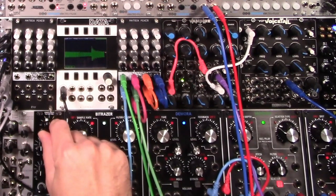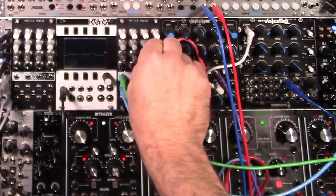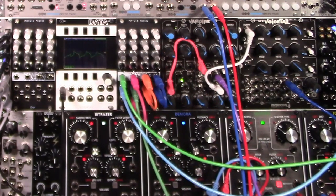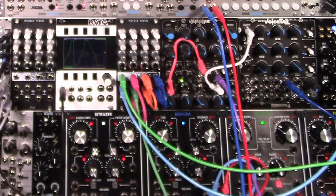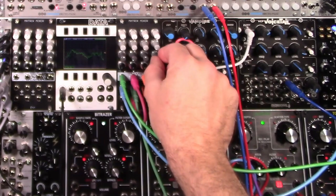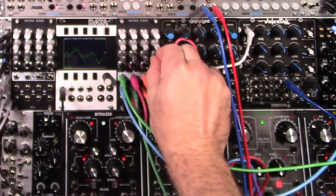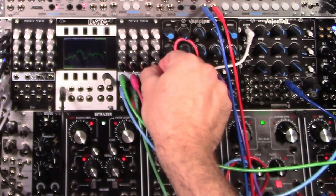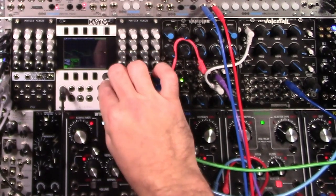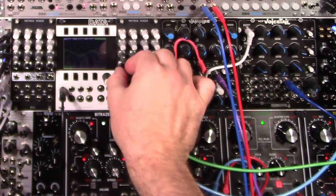Okay, the first delay style is the Tip Top Z-DSP with the Mariana Trench card. Let's listen to another algorithm on this card. This is the Unstable One algorithm. Let's go to 1 volt per division view. Okay, so we can see we're at approximately 2 volts peak to peak currently.